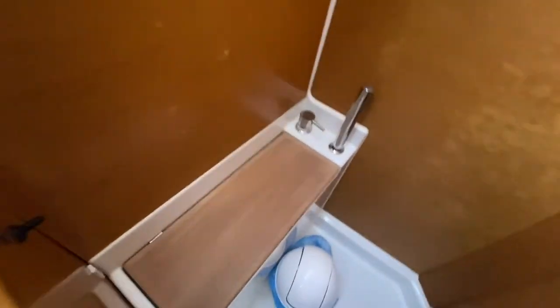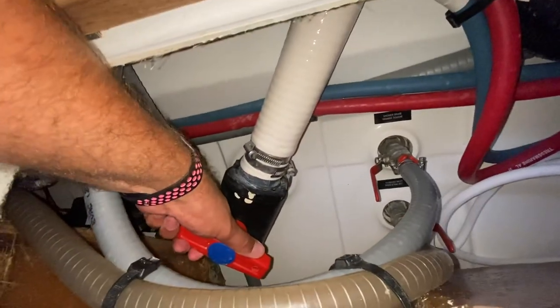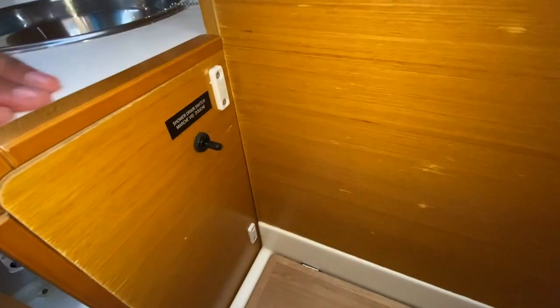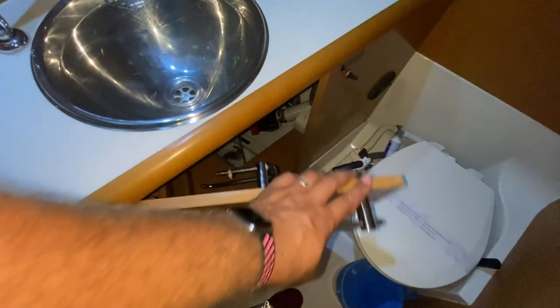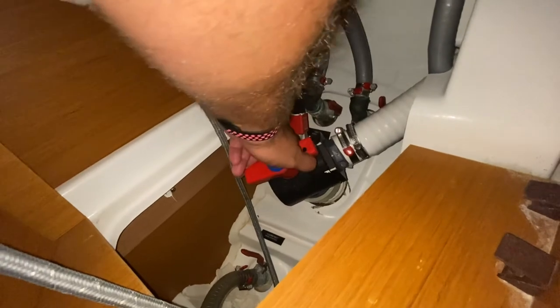Jean Mirage has two bathrooms, each with a head and holding tank for black water. In the aft port bathroom, the holding tank valve is located underneath the seat for the shower. In this position it is across the line and closed — turn 90 degrees to open. Remember, only open your waste tanks when you are offshore and away from other boats. In the forward master cabin bathroom you also have a waste tank valve located underneath the vanity sink — again in this position it is off; turn 90 degrees to open this valve.